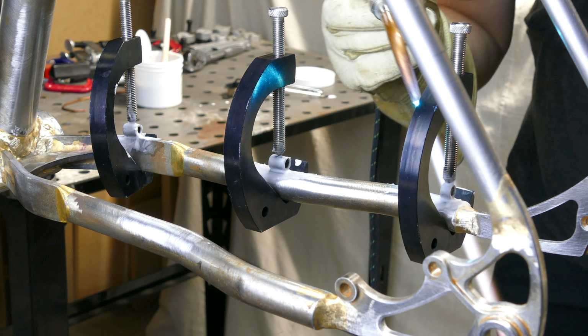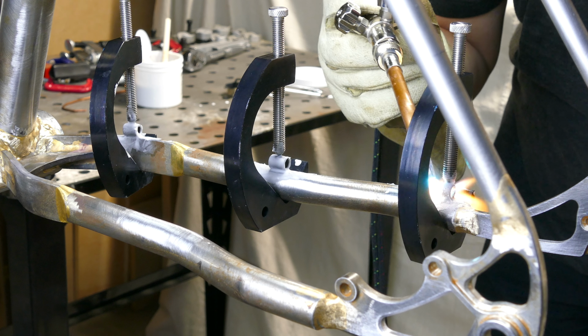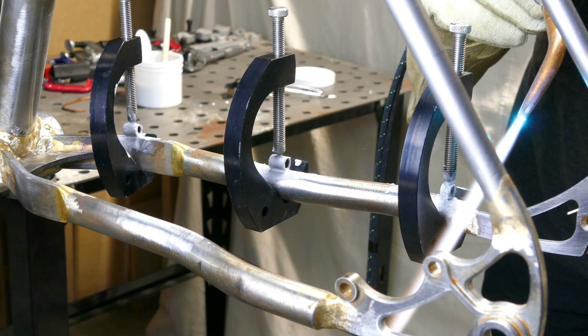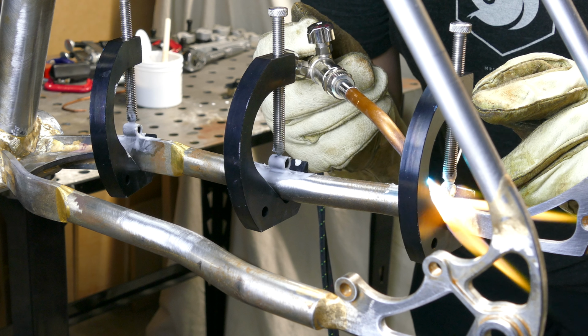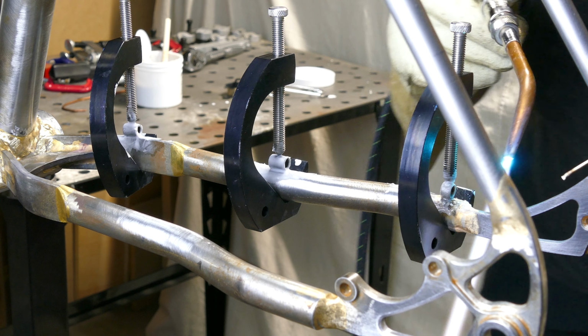I think I'm finally getting better at silver brazing. Everything happens so much faster than with bronze, and I have the tendency to get things too hot. I've finally gotten used to getting the metal to temp, adding the silver, quickly flowing it with the flame, and then getting the torch out of there. It also helps a lot to turn my torch way down when I'm brazing with silver.